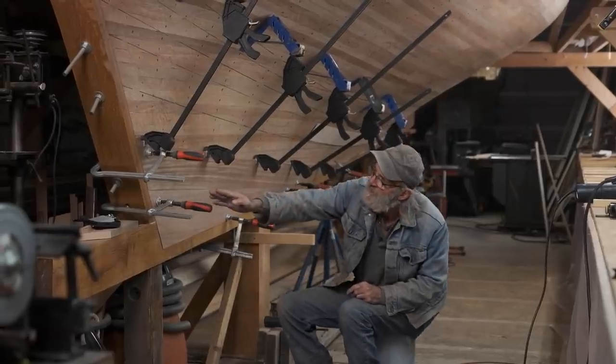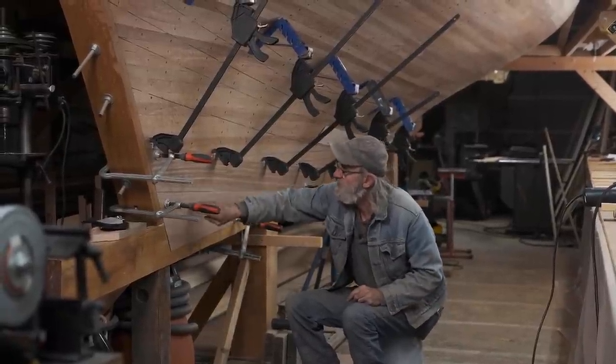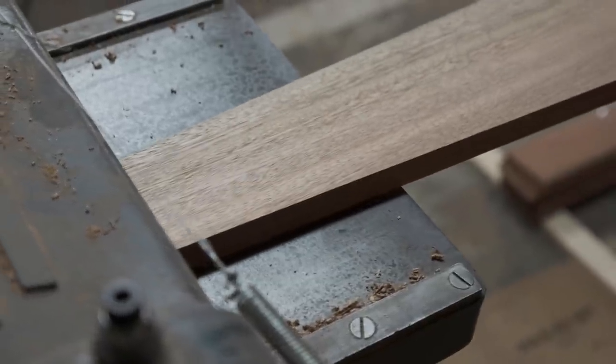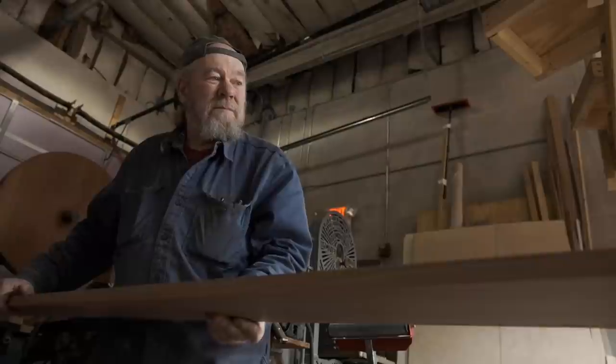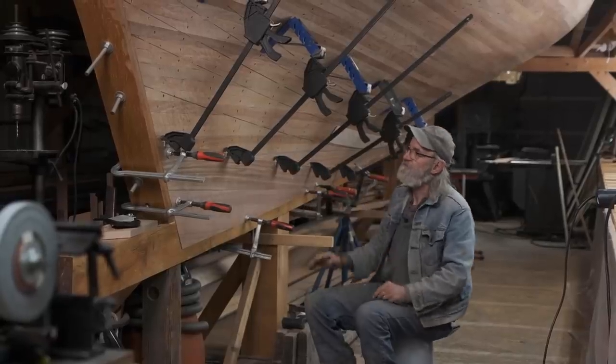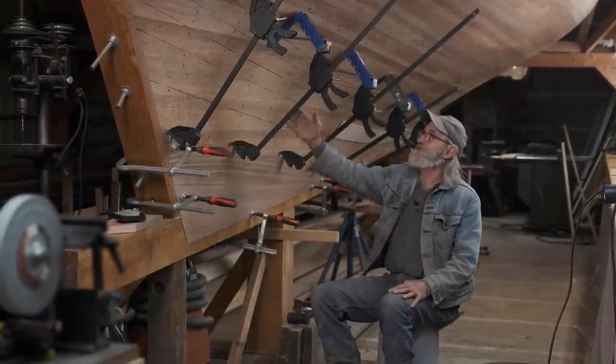You know, I may touch the end of it up a tiny bit, and you can see a little shadow here because this one's hanging out. It's a little bit thicker than this plank right here. We're going to run it through the planer again later, but we have to sculpt the back of it a little bit, a tiny bit up in the forward sections, make it round and fit it back in. And the next thing I want to show you is these things.